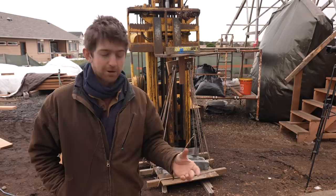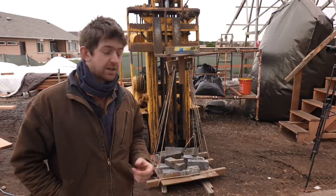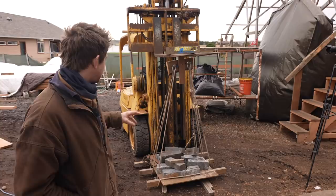They were slightly larger previously, and although there's a lot of them in there, so they should be okay, I just want to make sure that they're going to be strong enough. And if they're not, then we're going to have to replace some of them with bronze bolts. So right now we're going to do a shear test of 770 pounds on one copper rivet.